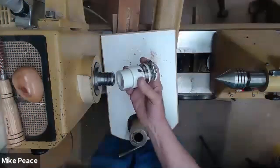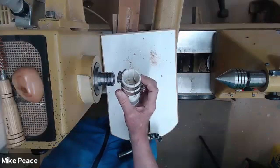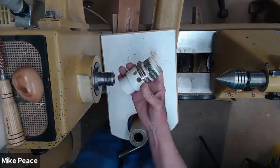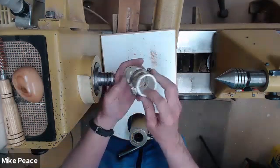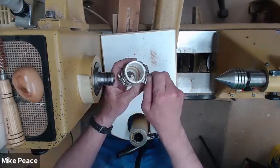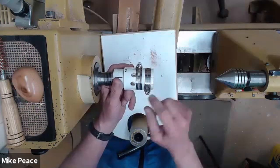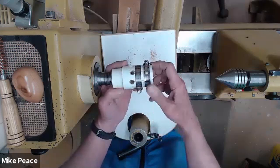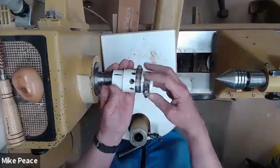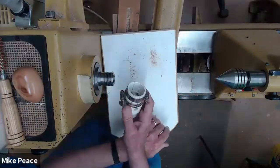Now, other types of collet chucks. Here's an egg cup. I saw plans for this on the internet somewhere. And if it's on the internet, you know it's got to be true. Well, this was kind of cockamamie. This wasn't real effective. You'd hold this in your chuck jaws. You got all these little slots on it. You put an egg in there, and then you have to use a screwdriver and really clamp down on it. And meanwhile, you got this pipe clamp coming around that's kind of scary. And I got it backwards. No, I don't. Yeah, you want it with the sharp edge coming, kind of passing you. It worked, but frankly, it does not work as well as that wooden jam chuck.